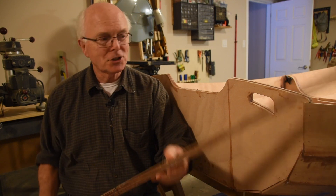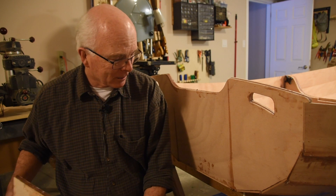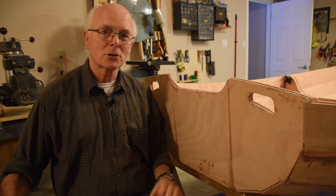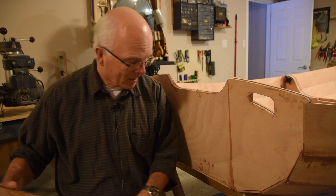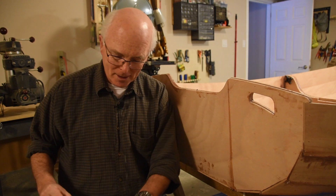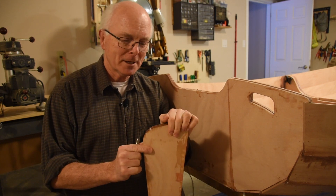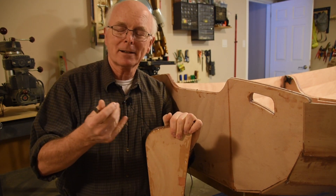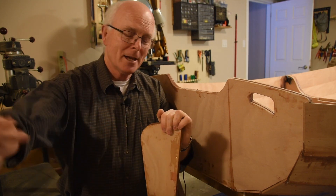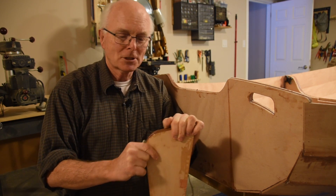One of the things we're going to be working on when we flip the boat over is attaching the skeg. We've already laminated two pieces of plywood together to make it, and we've got to clean it up a bit, but it'll be laminated on the bottom of the boat at the stern — it helps keep the boat tracking straight when rowing. One thing not mentioned in the plans that I might try, which I've done on a previous skiff, is to drill a hole about an inch and a half or so in the back, so that if I put the boat upside down on my sailboat deck or hang it in the garage, I can run a line or rope through to tie it down and keep it more secure.